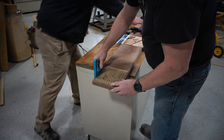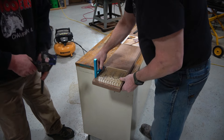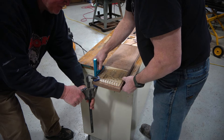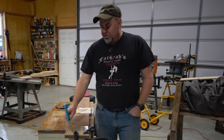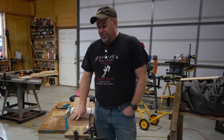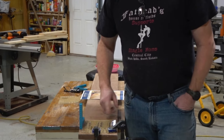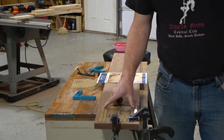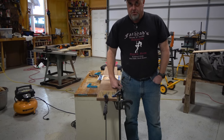I use these machine squares to make sure we're in a good spot and we're flush — centered on the board, at least that's how I want to see it centered. Just to back up: this board hasn't been sanded or anything. It's just a rough-cut board; we'll get to that after we're done putting in the holes. So we've got this clamped in. The next thing we're going to do is drill our locking pins in — we have two locking pins. Once those locking pins are in, we can remove the clamps and drill all the holes on this piece of the jig.